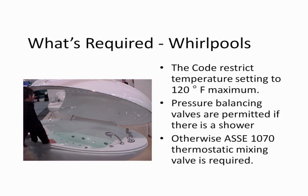If you're wondering what the temperature of the water was when I got to the scene for the 10-month-old child, the water temperature coming out of that spout was 141 degrees. So that child got scalded. The parent arrived within seconds, pulled him out, and put him in ice water. The child died 5 hours later. So we're looking at serious conditions, and we want to make sure we properly protect our hot water system for the public. Let's go into laboratories.